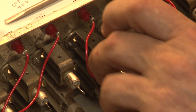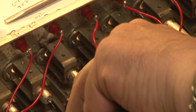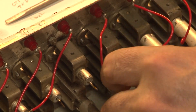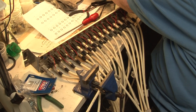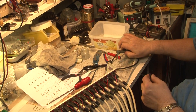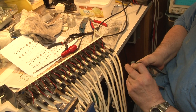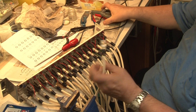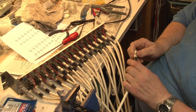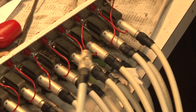Then we arrange the cable to come out of the side of the cover. I'm going to take the cover around. With the hellerman sleeve we just add a little bit of lubricant on there. Special pliers, which stretch the sleeve. And by careful use of all fingers, you slide it on, line it up, and then slide the tool out. And voila — one sleeve. It basically protects the cable, the exposed parts of the cable, from oxygen, so it keeps it airtight.